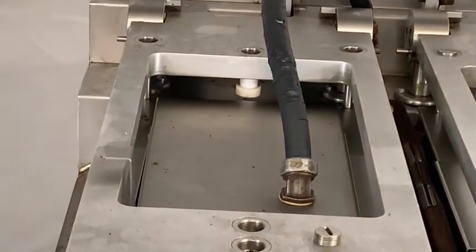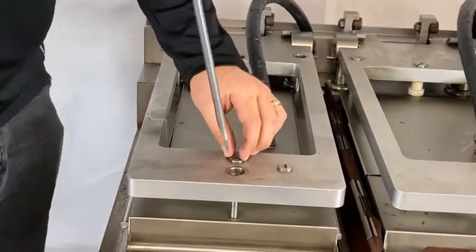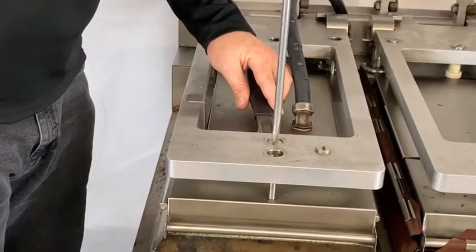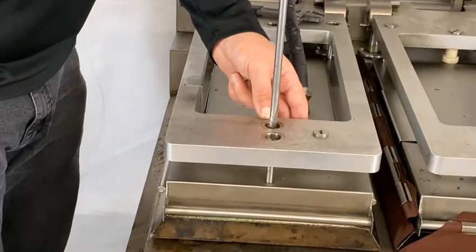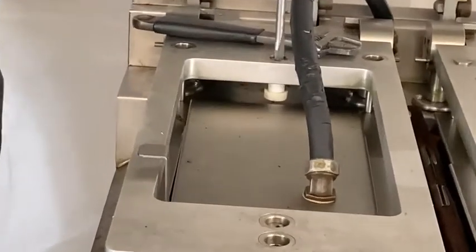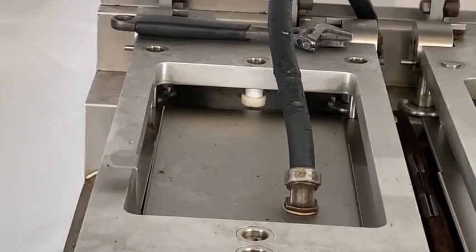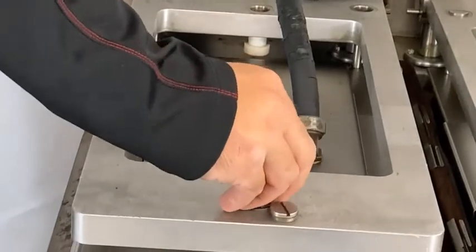With the locking caps installed, now do the magnets. If you have the newer style aluminum magnets, you'll need to hold it with a wrench — put your adjustable spanner in and hold the magnet. This unit has the old style white nylon magnets, so a finger will hold it while you apply plenty of torque to ensure it doesn't come loose. Repeat the process on the back. If you can't fit the locking caps, you may need to adjust the grill position via the reed switch or rack. Always ensure you fit the locking caps.